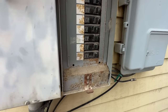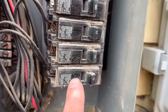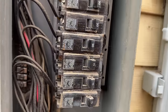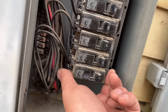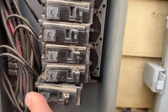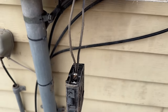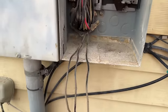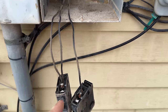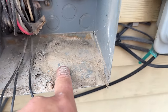We'll go ahead and take this cover off. Here's what you'll see when you get that cover off — we've got our two breakers down here that we're going to remove. Just be careful, being as this is live. You can turn off your main one if you wanted to. So we're just going to pull this to the left and it will pop out. As you can see, this one was double-tapped, which is not technically up to code. We're going to use this knockout right here, just a half inch, and we're going to run our whip through that knockout.